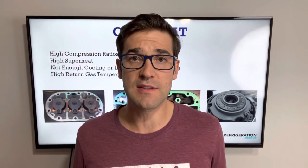If you haven't had a chance to look at it, I'm going to break them down step by step. We're going to go through overheat in this video. The biggest causes of overheat — and the biggest one is compression ratio. When I was a technician in the field, I did not know or look to check compression ratio. Compression ratio is the largest cause of overheat failure. Then we have high superheat, high return gas, and external cooling or cool gas not coming back. These are the things causing compressors to fail from overheat or start tripping off your internal overload. So let's get into it.